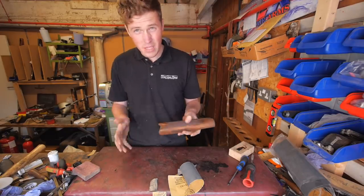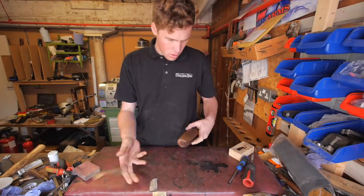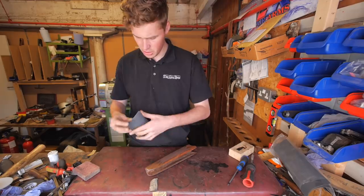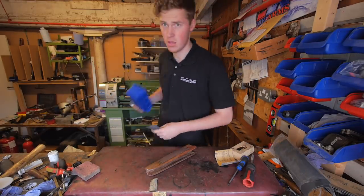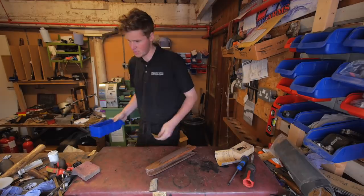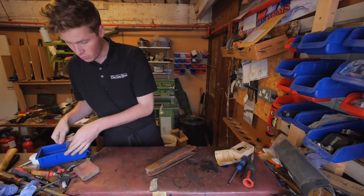So we've also here raised the grain a little bit. So we now know what we're on. So you can, at this juncture, decide A, continue dry, or B, go wet. Which is what I'm gonna do. The whole point of wet and dry is it will last longer if it's wet.